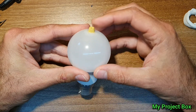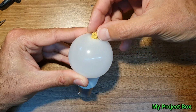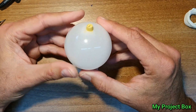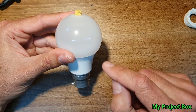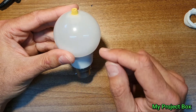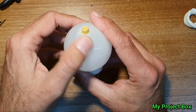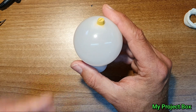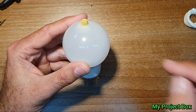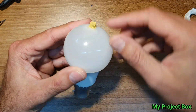So let me know what you think in the comments — is it a ridiculous idea to experiment with one of these cheap bulbs to add a dimming knob? I think it was a bit of fun. You guys could try this as well — from Poundland and other bulbs that use this similar sort of system with those two resistors that set the current and that current regulating chip. I believe the IKEA light bulbs use a different system — they use a buck regulator — but they also have the two resistors, so you can do the same thing: break the track that goes to the chip and put a pot on there to make the current to the LEDs adjustable and give it a dimming function.